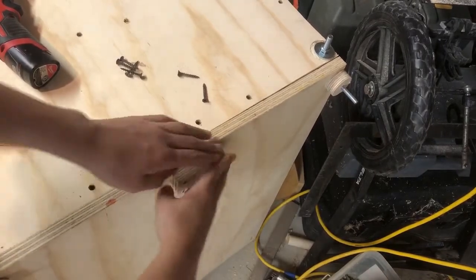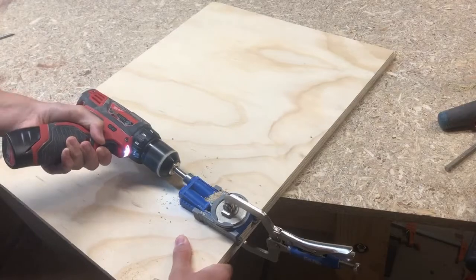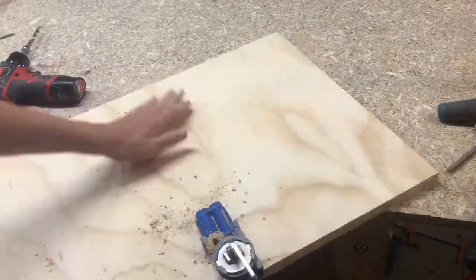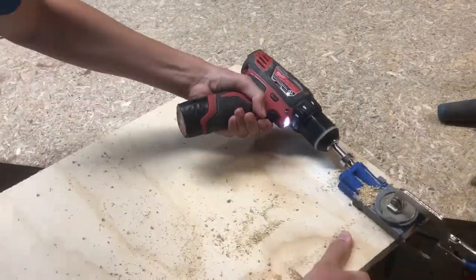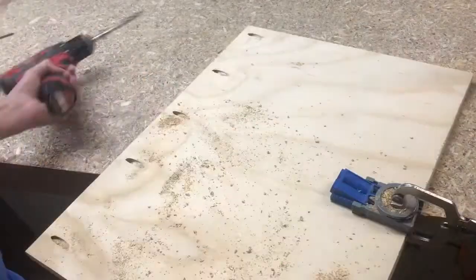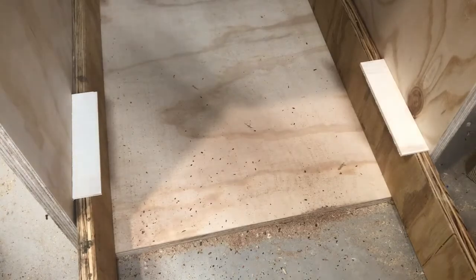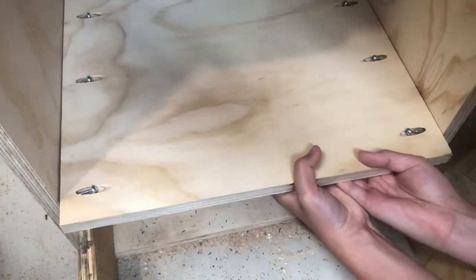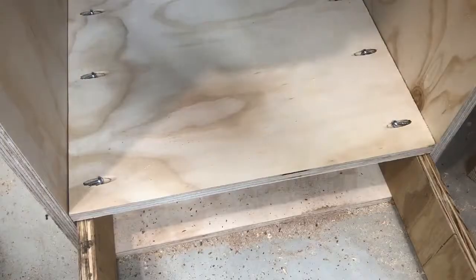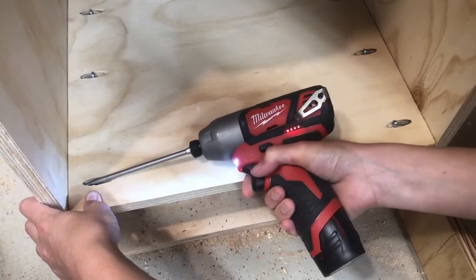Now I'm putting caps on the ends of the pipe to prevent it from moving. This is going to be the shelf on the bottom — I used pocket holes for this, drilling about five pocket holes on each side with my Kreg pocket hole jig. This worked well because it let me avoid measuring in from the sides. I used a strip I had as a spacer with a small shim on top to position the shelf, slid it into place, then drove in the screws. It pulled the shelf tight to the sides and gave the cabinet a lot more structure and rigidity.